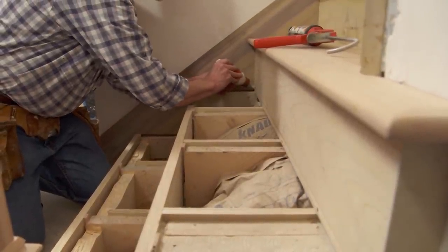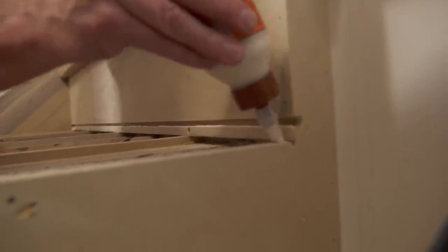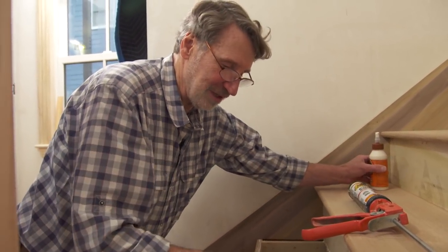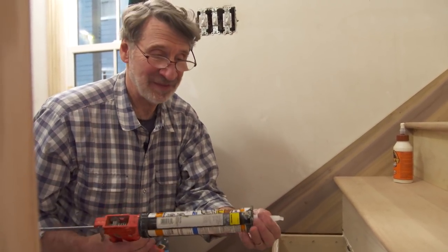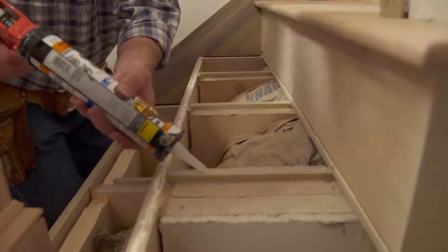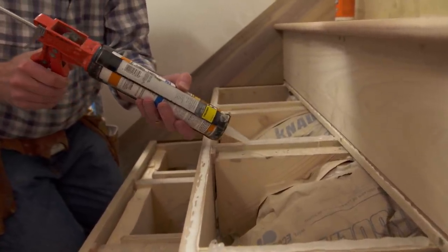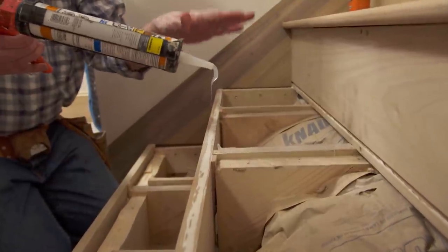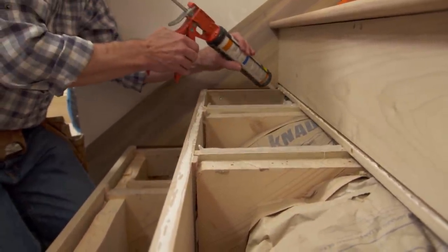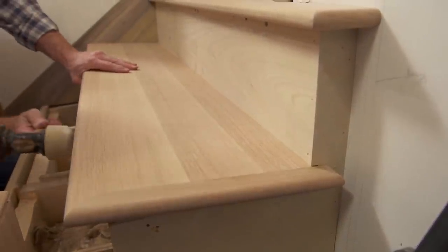So now we want to put some glue in this groove, and I want to put some on the top of this trim board. Now on the stringers we're actually going to use silicone. Why not glue? That's another tip from Matty — it's a good one. We'll put a nice bead down. The advantage of silicone over construction adhesive, which is often used, is that it's flexible and it'll stay stuck to the stringer as well as the bottom of the tread. So if there's any movement it softens the stair yet holds it all together — the no-squeak solution. Now we've got to get it back in there. Get it started, make sure it's down there, then get those blocks to just set.